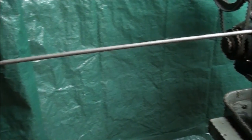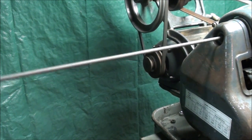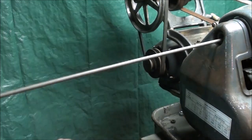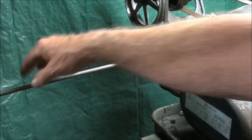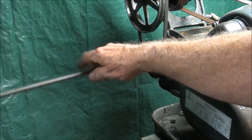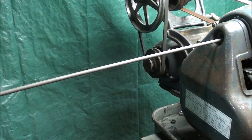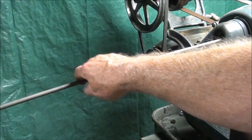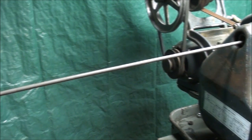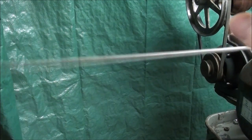I've got to stop for a minute and talk about safety on these lathes. Be careful when using any lathe — wear your safety glasses, watch your fingers, and follow all the other safety tips I've given you. Can you see this work starting to whip around? Visualize a 12-foot length of that unsupported. Even if supported by a stand, the larger stock probably won't do this, but once thinner stock starts whipping it gets more and more violent until it might bend and start whipping around — and it is absolutely lethal. It's so scary and so noisy you're afraid to approach the machine to even turn it off. With larger stock, it becomes so out of balance the entire machine, if not mounted to the floor, vibrates and you're afraid it'll tip over. Long stock at higher speeds is a very real danger.